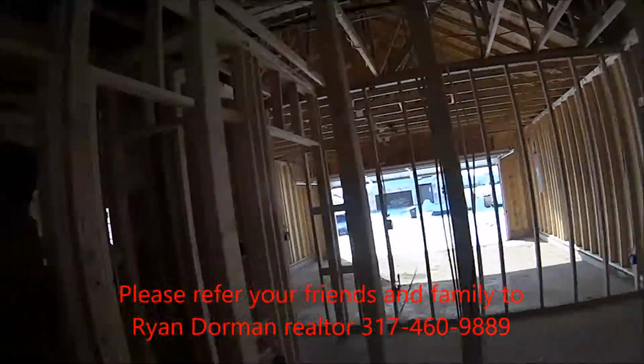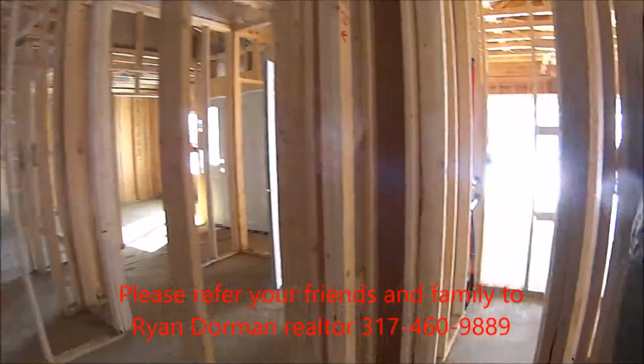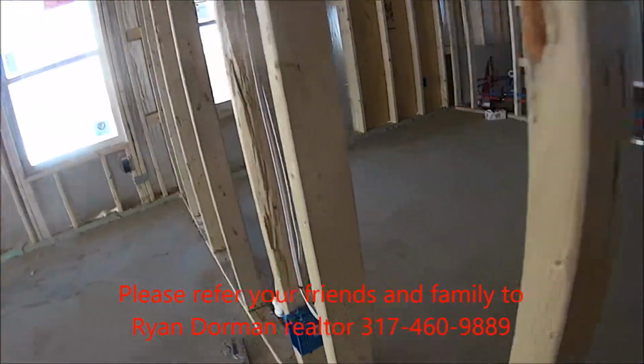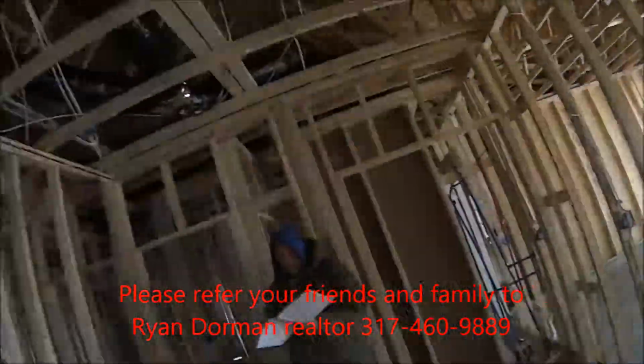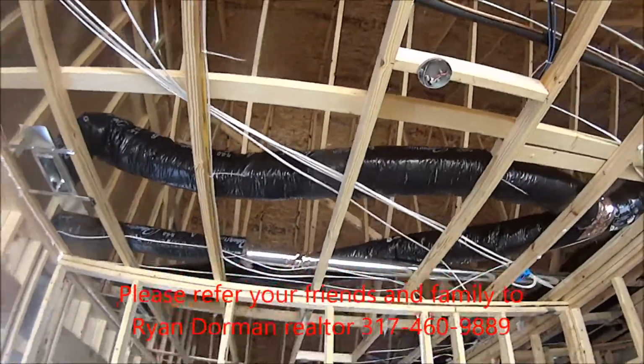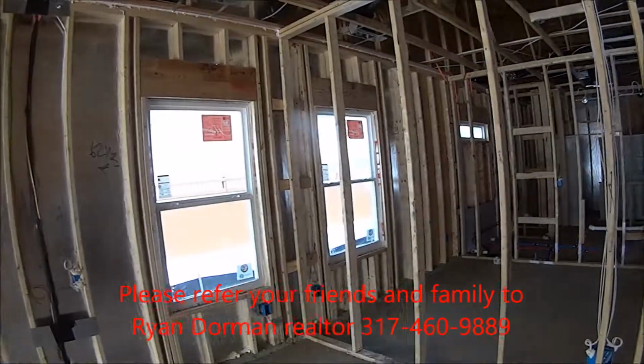Same thing for bedroom 3. Three switches as you come in. Two for your pre-wire, one for your half hot, which is this one over here. Smoke detector as you walk in. Outlets around the room. No TV or phone in here either.